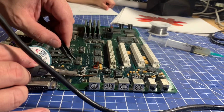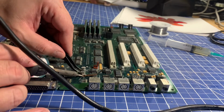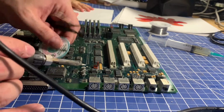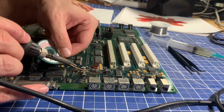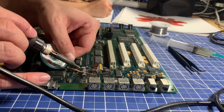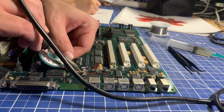What is the problem with it? With what? This computer? Yeah. Not really a problem. It works okay. It's just that it's got leaky capacitors, and eventually, if they're not replaced, they'll eat into the board and cause the computer to be inoperable and maybe irreparable.